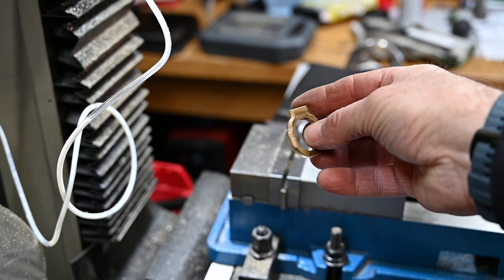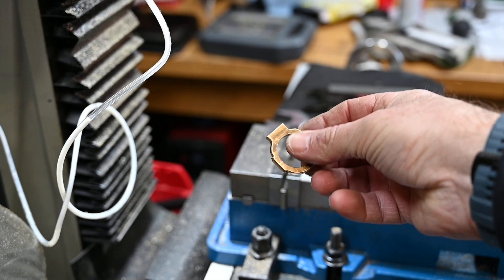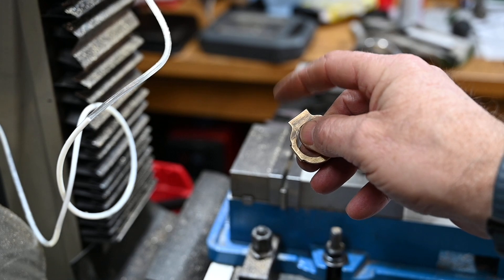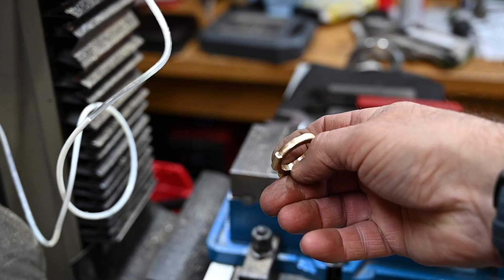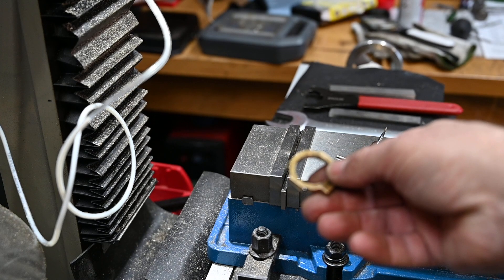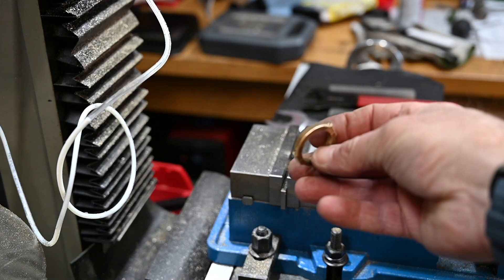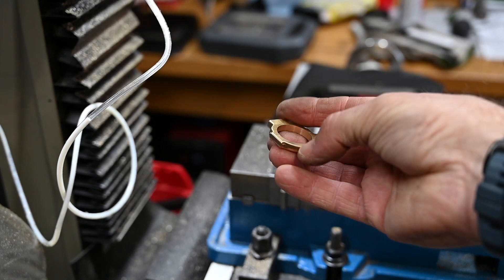There it is — it's bolted together. This side here has a rod bolted to it. I've just got to put a small groove up the inside so it sits over the protrusion in the eccentric. So that's the eccentric strap. There are two of these but I'm not going to show the other one.